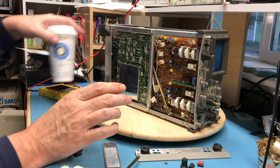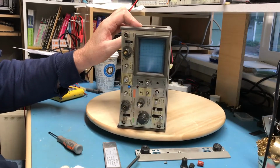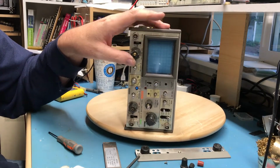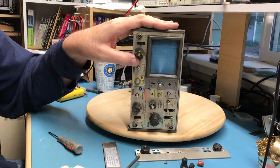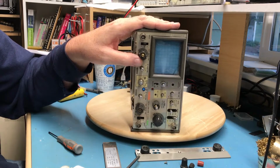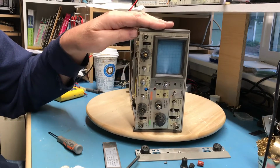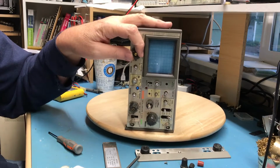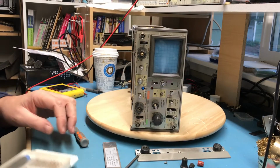And the idea between the two is to get a functional analog scope. There are times that I personally find a CRT style scope is really best for the work you need to do. I've got a really nice digital scope. It's really an excellent tool, but like in XY mode, I just find it very lacking. I'm not happy in XY mode on it for the things I want to do. And of course, the persistence on the CRT here is what makes this work so well in XY mode, whereas you know they try to emulate it in software. To me, it doesn't emulate really well.